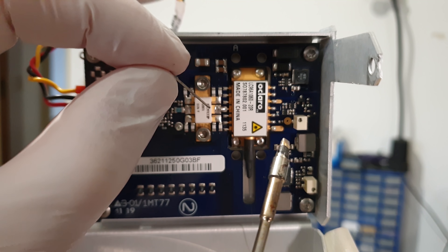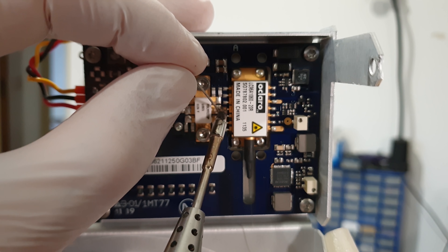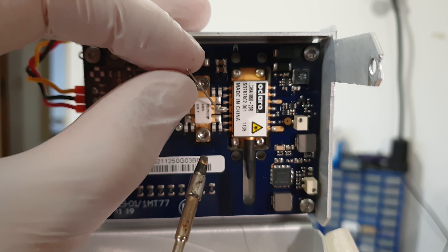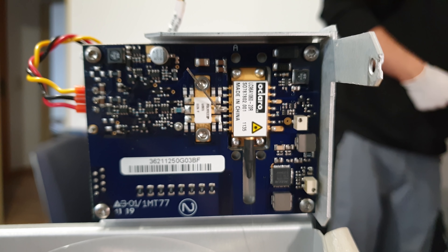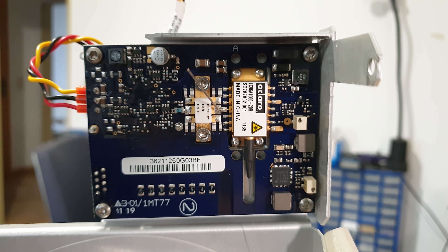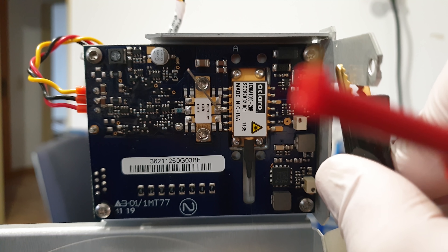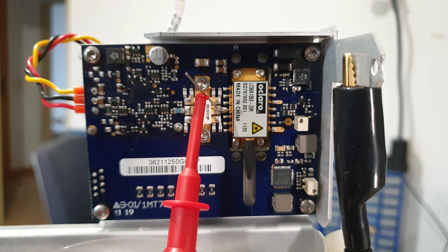We want all of that stored energy squeezed into an ultra-short impulse. That's where this last board comes into play. It has another fairly low-power fiber-coupled laser diode specialized on pulsed operation, and so is the high-frequency MOSFET next to it. Controlled by that FPGA board, these guys become a master oscillator — a so-called seed source — for correctly timed short impulses, which then get amplified by all the energy in the active fibers. I still don't have the pin-out for that FPGA controller board, but as luck would have it, I do have another source for precisely shaped and timed current pulses.